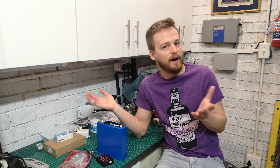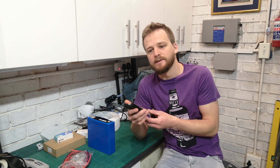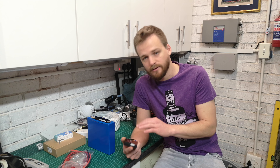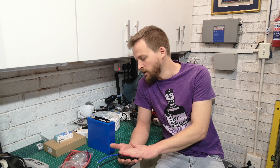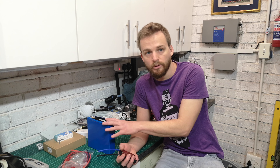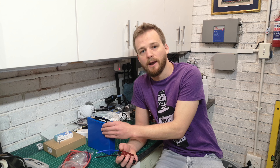So it doesn't really affect me - I've got a 24-volt inverter already and that's what I'm going to make use of. As well as these batteries, I've got this - a BMS, a battery management system. What this does is you connect it to your battery pack. Firstly, it limits the charge and discharge current of your batteries. I've bought one that's got a 30-amp charge and 60-amp discharge limit, which is more than sufficient for my needs. The other thing it does is it monitors each cell individually and balances them to make sure they're all sitting at the correct voltage all the time, so you get the best possible output and lifespan from your batteries.